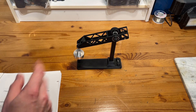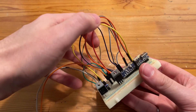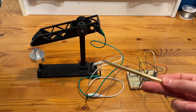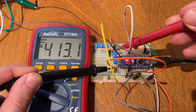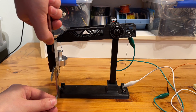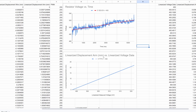What this means for us is we can vary the heating of the wire based on the position we want it to be in. Because the resistance of the wire changes with respect to its length, we can set up a circuit that measures the resistance and uses code to add more or less power to contract or extend the wire to the desired length. To do that, we'll take a resistance measurement by measuring the voltage across an in-series resistor every 10 milliseconds, while also taking displacement measurements at max extension and max contraction. Because the expected resistance-displacement curves are linear-ish, we'll plot and linearize the data to develop a resistance-to-extension formula to drive a PID controller.